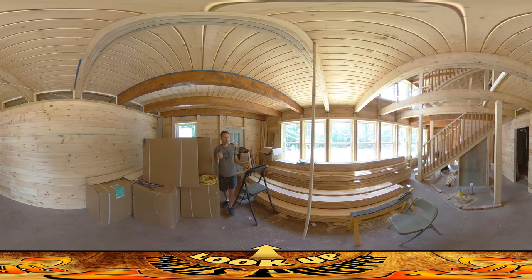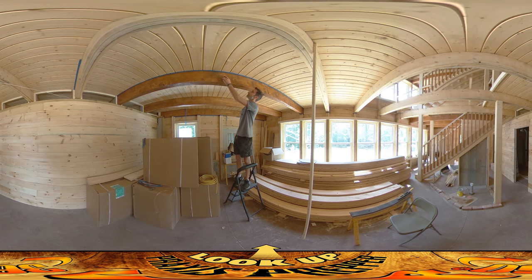The last thing that I did, and I'm just about to finish it up now, is these ceiling joists here. I got them all taped up — this one all taped up — and I'm starting to tape the other ones and stain them down. With the stain that I'm using, the process is you put the stain on, and then you wait about 15 minutes or so, and then you wipe off a little bit. That kind of takes it off of some of the harder wood areas where there's knots and things. It makes them a little lighter, makes other areas a little darker, just adds kind of a marbling feel to it, and I think it enhances some of the beauty of the wood. You don't have to do that, but I like to do it — I think it makes it look a little bit nicer.